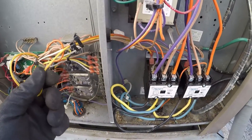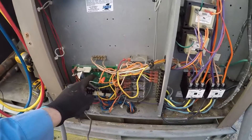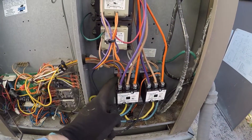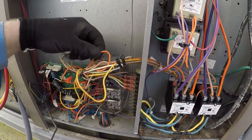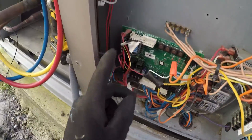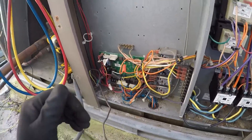Wire 247 — you can see it's the same wire — is connected directly to the contactor. When I pull on this wire it moves the contact. So they went from the cooling wire Y1 directly to the board, but the board is not going to shut off the contactor if any safety opens, because they wired it as a direct shot straight to the contactor. That orange wire in the back is in the same loop.